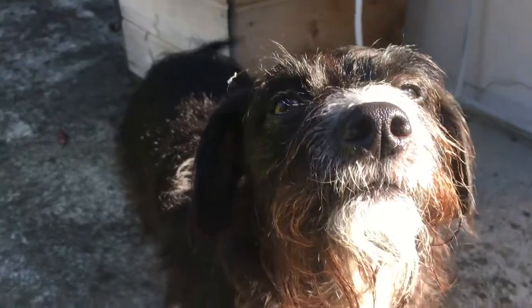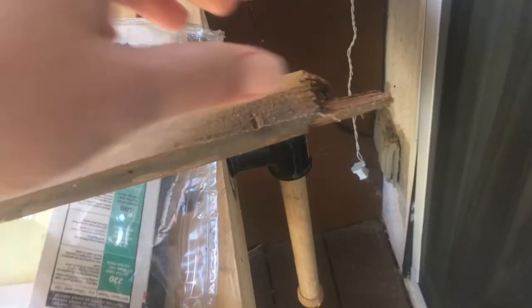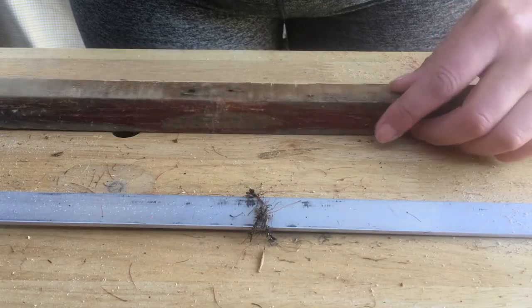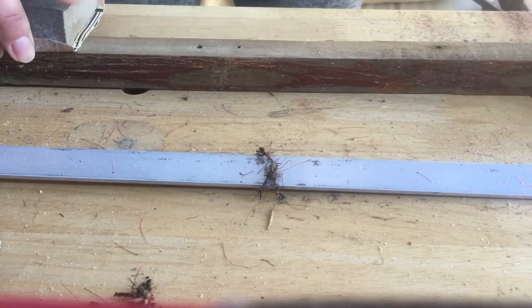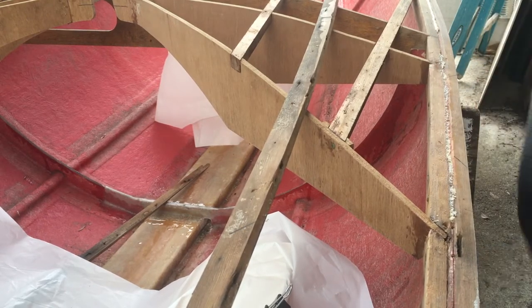We had our inspector on duty — I think she was trying to tell me this is not right. So here we have essentially an outer gunwale, like a wing. There's one on each side and this goes outside of the gunwale. There's a bolt that went through and it just disintegrated when I took it off. I'm going to try and save these and clean them up and put it back together. I'm just really trying to save as many original pieces as possible. And those parts where it really didn't come together, I ended up using some Gorilla Glue and patching it all up.